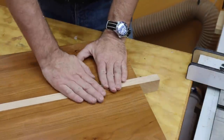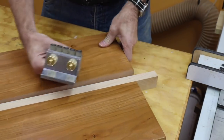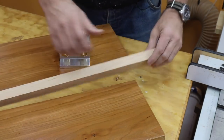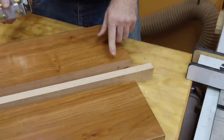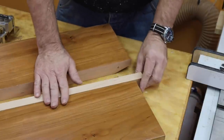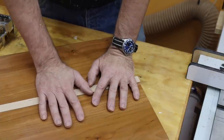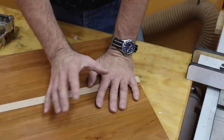I need to have an absolutely perfect top when I connect this, so I'm going to use my DowelMax jig. Some doweling jigs will run a line of dowels down the center, but this jig indexes off one face so all the dowels are offset from the same face. I will offset everything from this face when I put in the dowels and that will force this to be perfectly aligned when I glue it up. You could get the same with a domino or a biscuit — I find a biscuit joiner would work, but there's a little bit more slop in the biscuit.